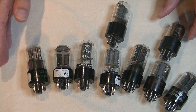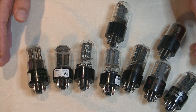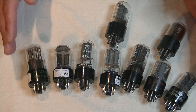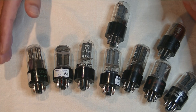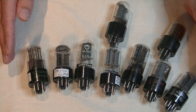The second generation, the GTA — here's one right here — with a maximum plate voltage of 450 volts DC, an increase of 150 volts, which works out to a 50% increase. And not surprisingly, maximum watts is either 5 watts per plate, or a combined total of 7.5 watts, again an increase of 50%.